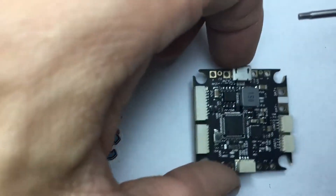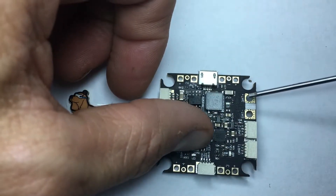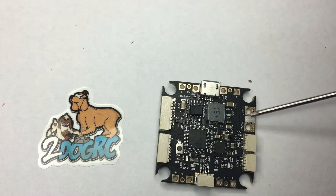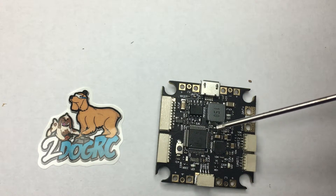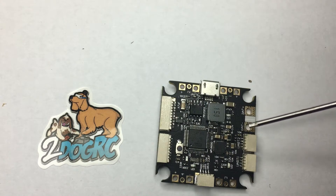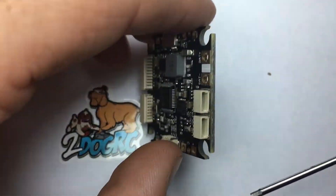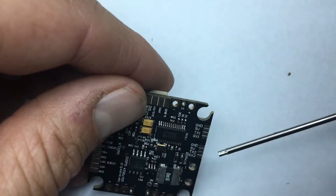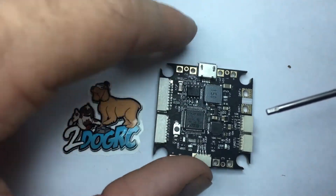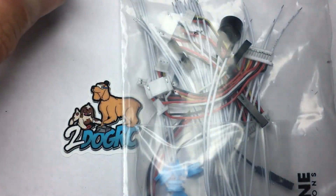So let's flip it over. You've got your USB here. Here's where your battery connectors go. You don't need to hook a VCC battery up because right here is a VCC — the flight controller is going to know your battery voltage and also get the current pulled through these tabs via that current sensor on the back. Here's UART1, UART2. The layout is the same as on the bottom — it tells you RX, TX, 5 volt, ground. And you get connectors. This comes with all the connectors you need and then more — a nice big bag of connectors.